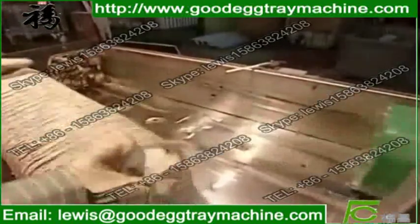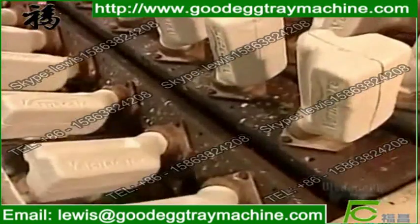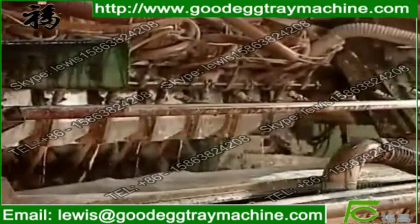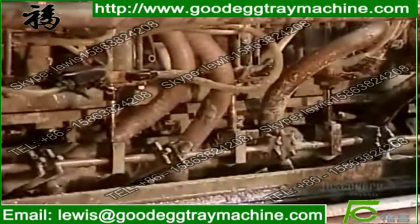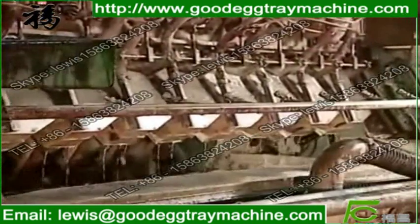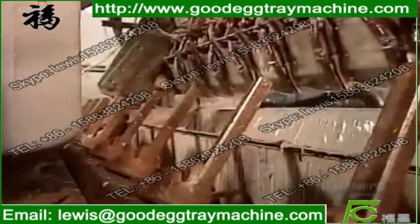The factory also makes disposable urinal bottles for hospitals. They add chemicals to the pulp to make the bottles liquid tight. These molds are three-dimensional and lined with mesh on the inside. When they submerge into the pulp vat, a vacuum sucks in the pulp. When they resurface, water jets rinse the excess pulp off the bottle necks, and the vacuum sucks out the water.